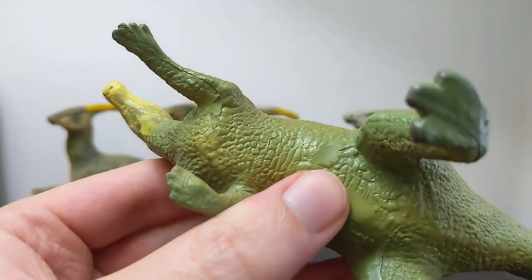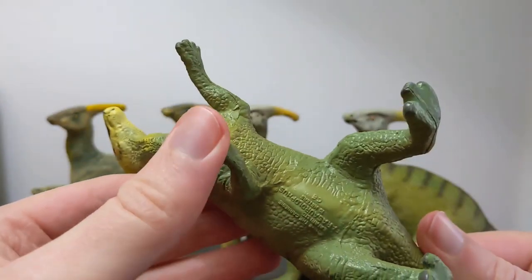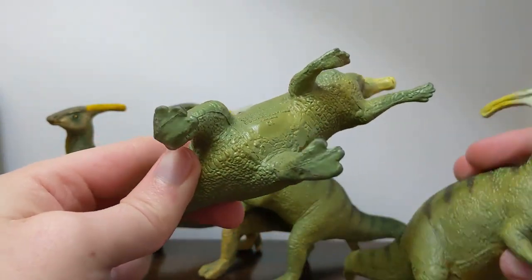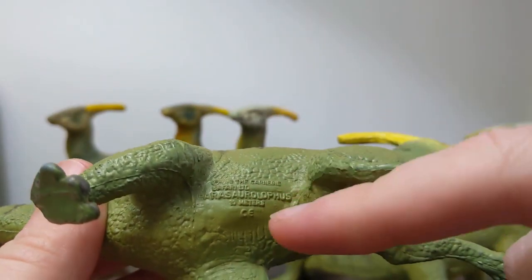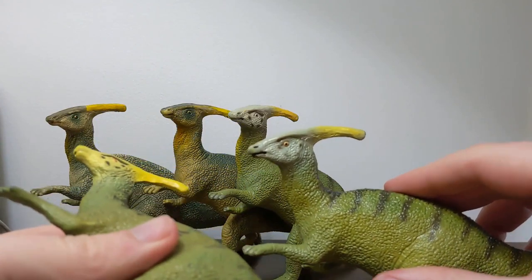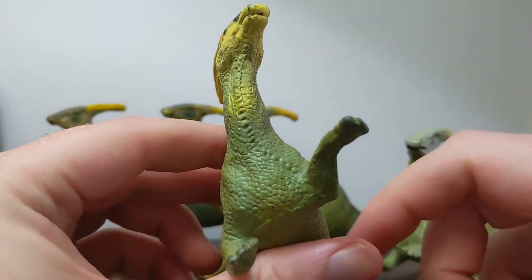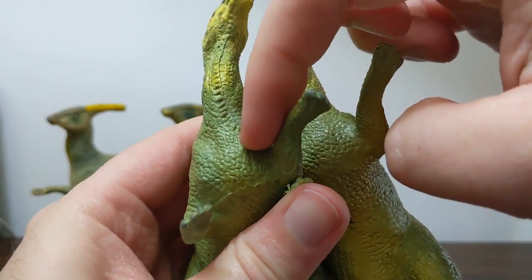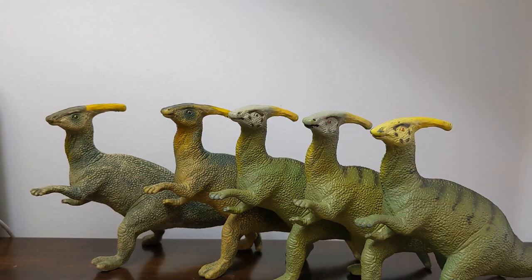This mold is still the same mold, just retooled a little bit to reflect changes to the belly stamp. The stamp has eliminated the words 'Miami, Florida,' eliminated 'made in China,' and added the CE mark. The biggest visible difference is the color of the head — they eliminated the white face and gave it an all-yellow head, with a little bit of yellow continuing onto the throat. You can see the mold fatigue really clearly along the mold line on the neck, where it's just starting to buckle. This mold was in desperate need of replacement.